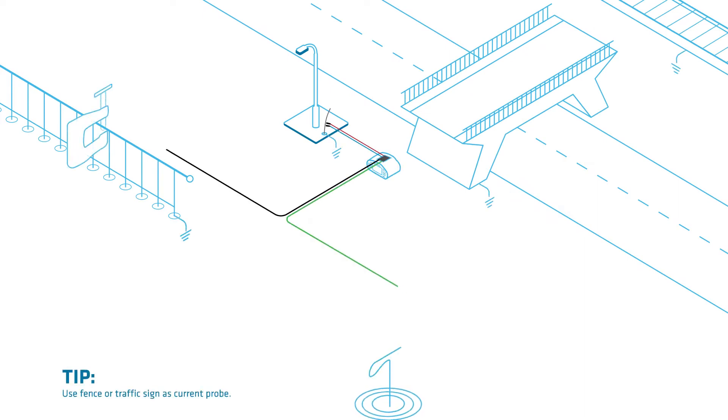From a bird's eye view, they should form a triangle, with the joined red and blue leads forming the apex of the triangle. In this manner, we largely eliminate the effects of the voltage funnel, which is even more prominent when using short test leads or when suitable soil for voltage sensing probe placement cannot be found.